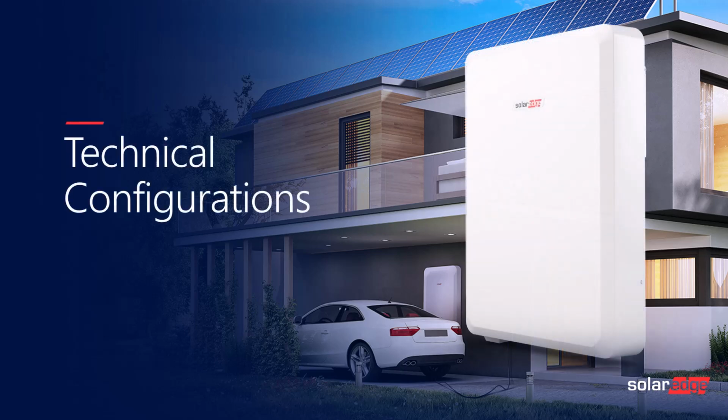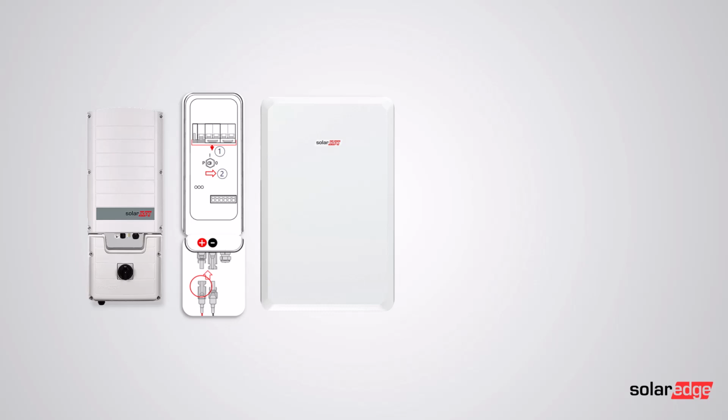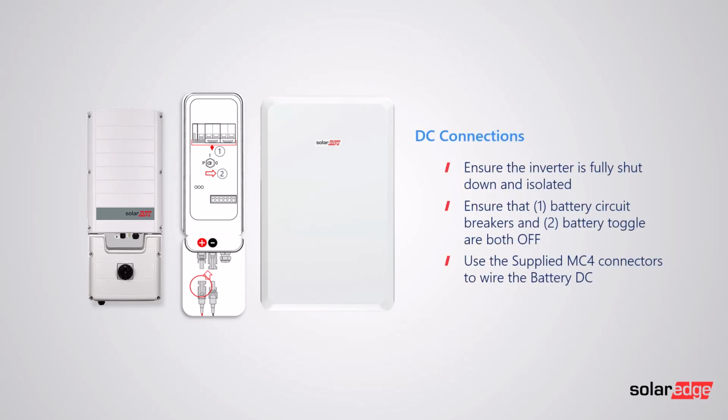So now for the technical configurations. The residential three-phase inverter, that's the SE5K-AUB through to the SE10K-AUB, is now compatible with the SolarEdge home battery. Before you wire it, make sure that everything is fully shut down and isolated, as well as the battery, and use the supplied MC4 connectors to wire the battery DC.